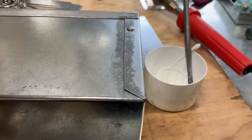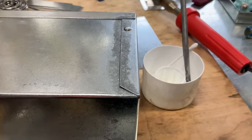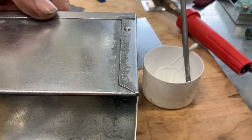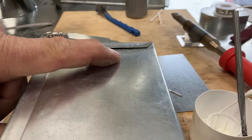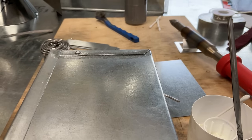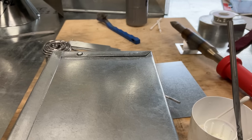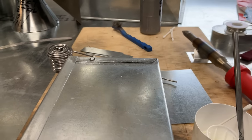One of the things about soldering is it doesn't like a gap. So your seams have to be very close and very tight for solder to work its best. See, I only have one rivet at the top. There's a little gap right here, and the solder doesn't like that. So what we're going to do, let me see if our iron is hot enough to...